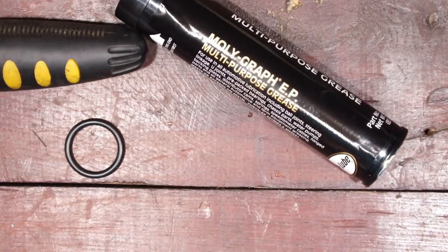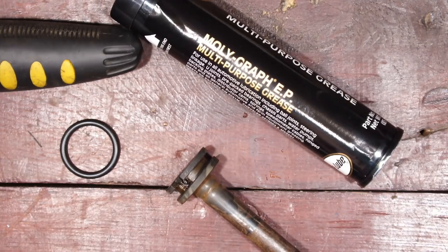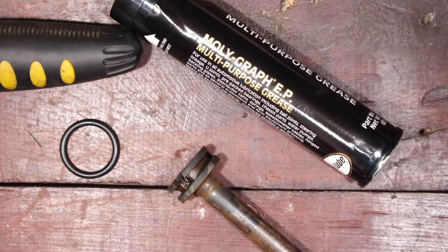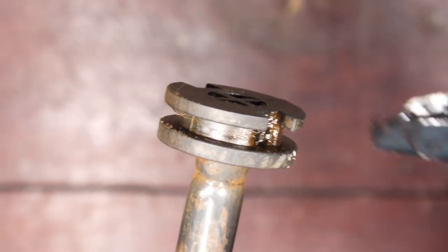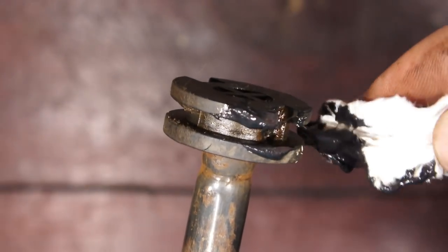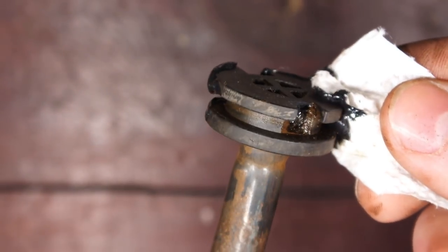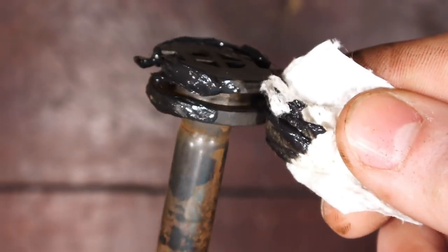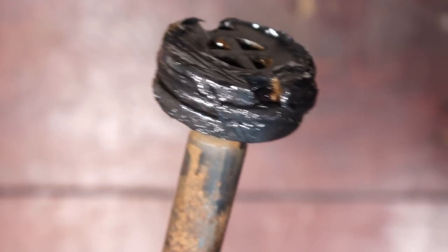The kind of grease I'm going to use is molybdenum graphite. It's a very good general purpose grease — lots of greases you could use though. To put the grease on I just dipped a paper towel into the grease and then used that paper towel to spread the grease all the way around the end of the piston and on the o-ring. You want to be pretty liberal with the grease because it's going to have to spread inside of the chamber as well.